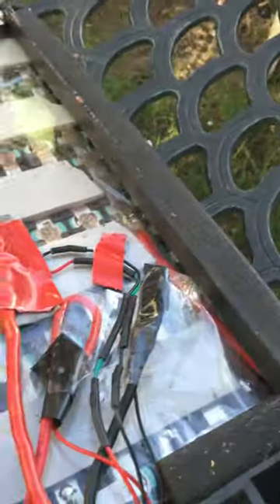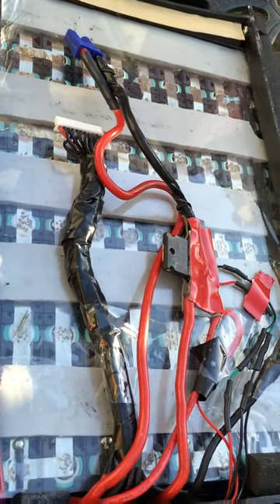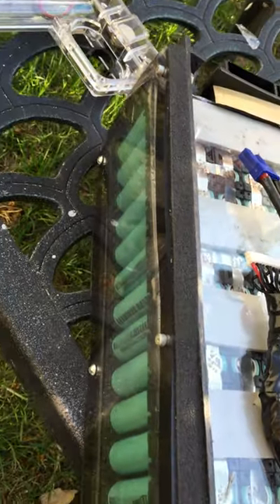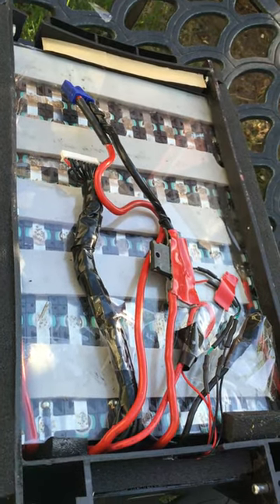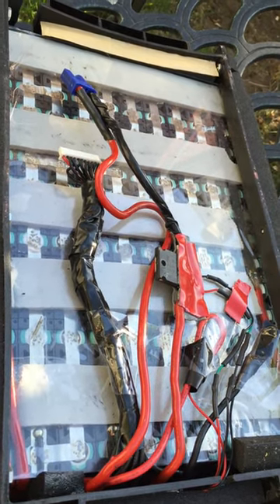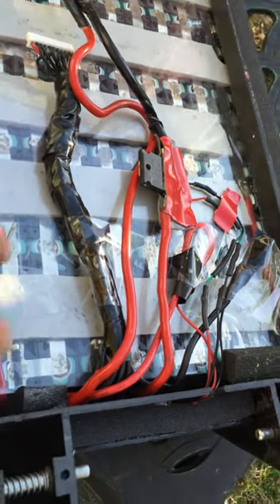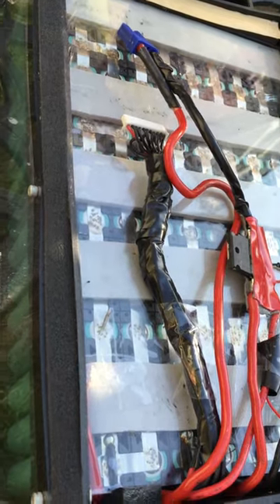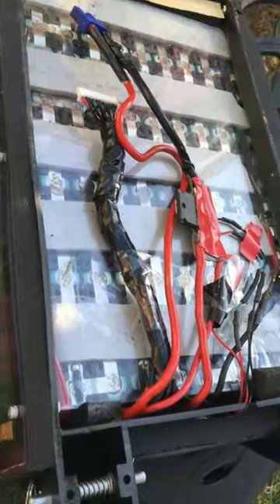This is the battery monitoring system. I use both this display and a balanced battery pack — it's a 10S configuration, though I don't have the balancer plugged in right now since I'm still testing. This pack is specced out at 33 amp hours with no problem — it does 60-amp peaks. I have really no voltage drop on the board at all. I run standard LiPos and can get about 15 amp hours, but you will get voltage drop. Using more batteries in parallel allows you to use a cheaper cell without voltage drop because you're making up for it in sheer battery count.